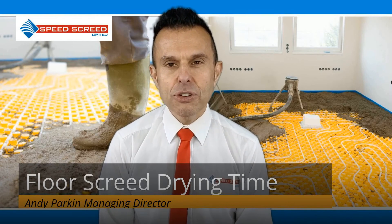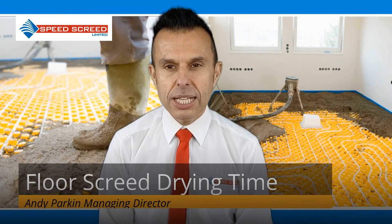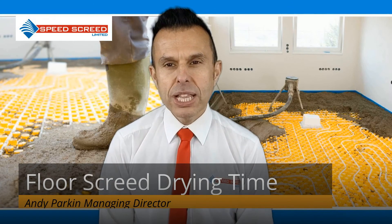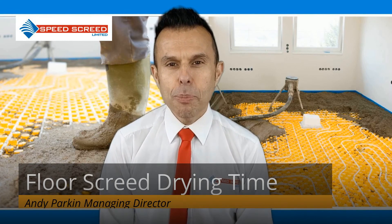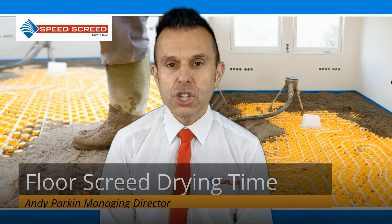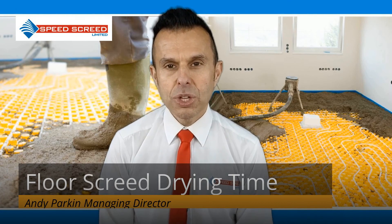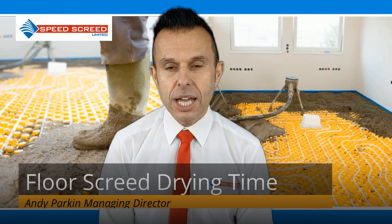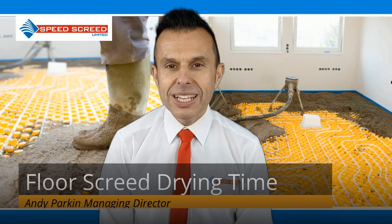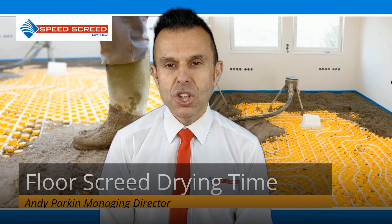Other common types of screed have different drying times, so always check the manufacturer's guidelines and be sure to do a proper test before moving on to the next stage. There is no one size fits all when it comes to floor screed drying time. One of the best ways to help you plan your project is to take account of what the likely weather conditions and other environmental factors are going to be when you expect to start the screeding process. This will give a good indication of any delays in drying time and help keep the project on track. If you have any more questions about floor screed drying time, just get in touch — we are always happy to help and give advice on the best floor screed options for your construction.